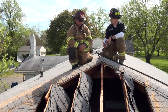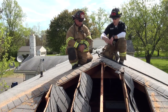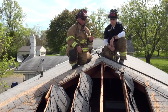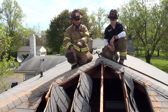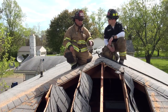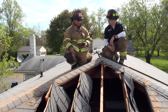This cut is useful for smoke relief or ventilation needed in a bedroom unit where we don't want to make a regular square hole. Looking at how this roof is constructed, it's going to give you a pretty safe platform to operate on. This hip area is one of the strongest portions of the roof. It's an older style construction using rafters and plank boards as opposed to OSB sheeting, so it's going to give you good work time and a stable platform.